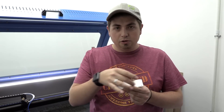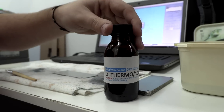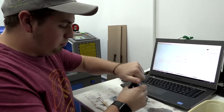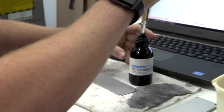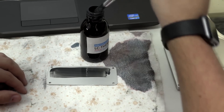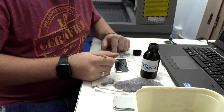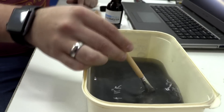So we have to apply a special paste that allows us to engrave on metal. The Thermoliquid from am.co.za is a thick paste designed specifically to stop reflection on metal surfaces when using laser machines. Without it, it is very possible for the laser to reflect back onto itself and damage the tube. The ink is applied with a paintbrush in thick, solid strokes. Always rinse the brush off in clean water, as the residue of the Thermoliquid can be collected and reused.